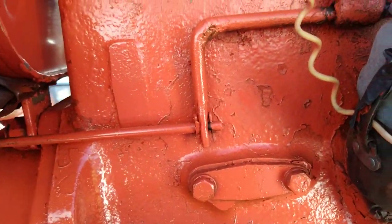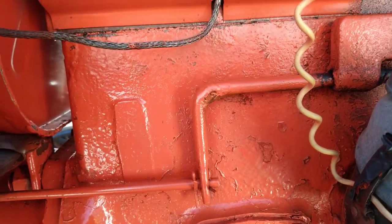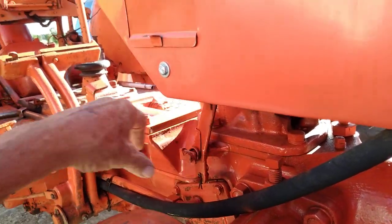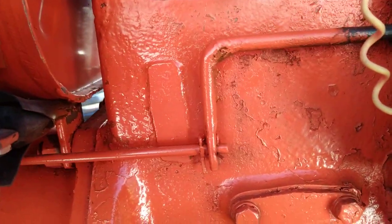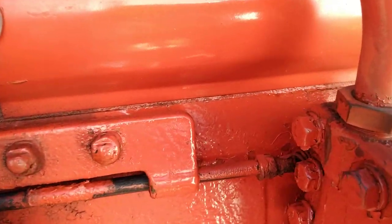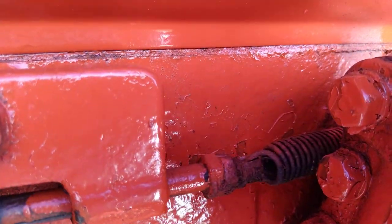Crawling around on my hands and knees here — hope you realize this is at great expense of my physical well-being. Anyway, this throttle back here, which I'm operating with my hand, which is also operating that pedal, pulls on this rod, which travels through this bushing assembly behind the distributor or magneto, whichever you might own, bypasses the hydraulic pressure pump, and pulls on a spring there. You see that spring?